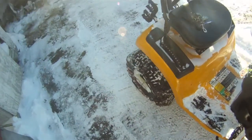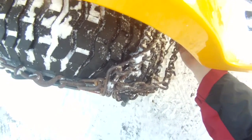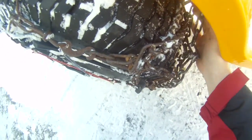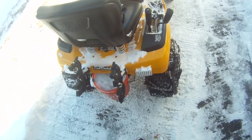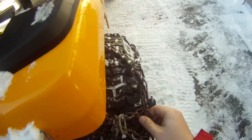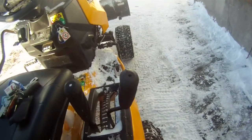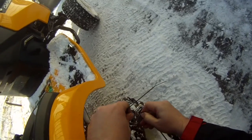I took the torch and heated up the ice to give me some more room. I also noticed there was a clanging coming from the right-sided tire chain. When I cut these, I cut them out of old truck chains, so there are two extra crosslinks that are basically a flap of extra chain. They're tight on the wheel, but those two little crosslink sections have been hanging and finally worked loose due to use. So I took some zip ties and loosely secured them — I'm not operating at high speed so I don't have to worry about them flailing off. This just tidies it up and makes it quieter so I don't hear it clicking against the PTO engagement lever or the deck height lever.